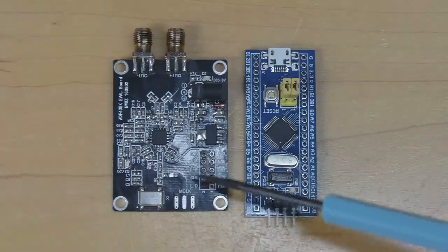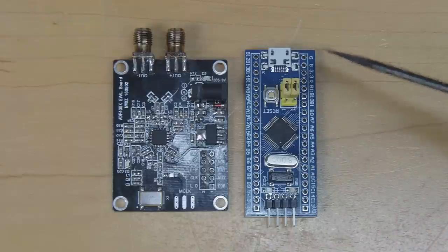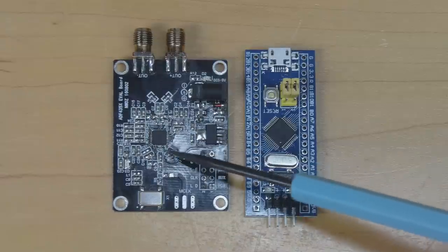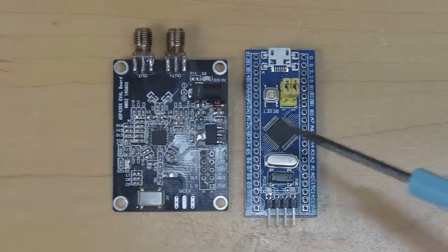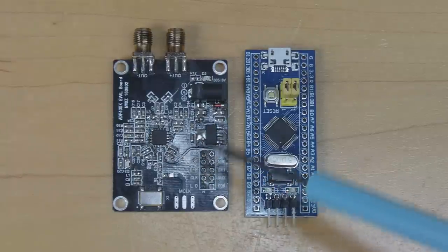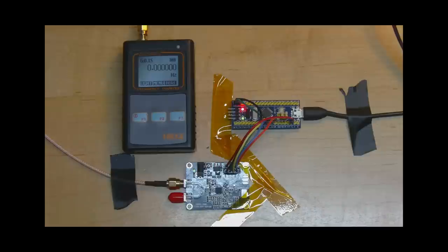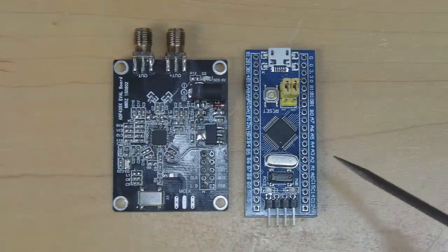This thing can be controlled over SPI, and I've got a little microcontroller — the STM32F1 — being used as a bridge between the PC and the synthesizer. Commands can be sent in over USB, received by the microcontroller, and in turn the microcontroller uses those commands to control the synthesizer chip. It's worked out very nicely, but up until this point it's all been an unstable prototype — just two boards carried loose, attached with jumper wires.